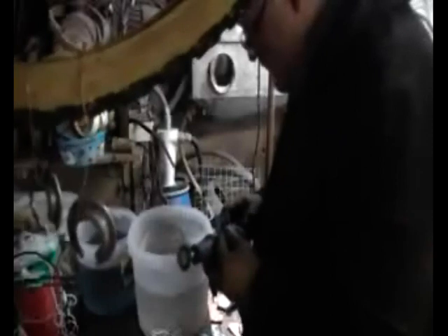Just make sure there's no grease or sticky fingerprints on it — I should be wearing gloves at this point, I didn't realise I'd taken them off. As you can see, the part is hanging from this tyre — very useful rack. Give it a good rinse, and there we go, number two done. Same again — leave it hanging overnight, longer if possible. The longer you leave it, the better the chrome passivate works: the harder and more rust-resistant the finish. And there it is in place. Quite happy with it really — at least it won't rust.